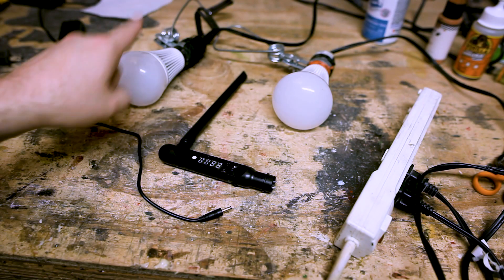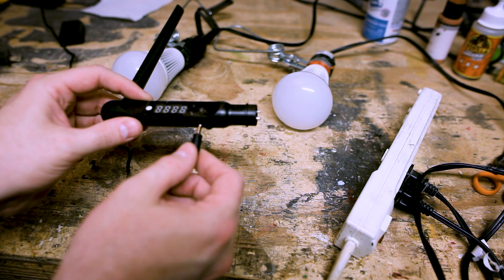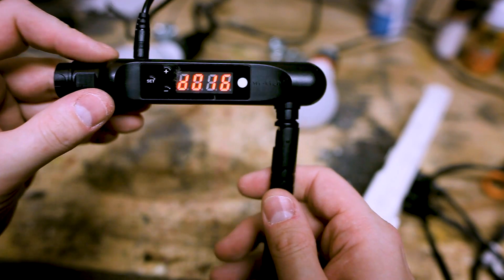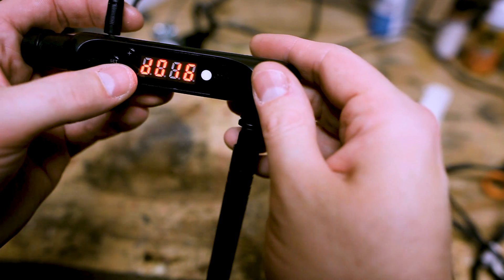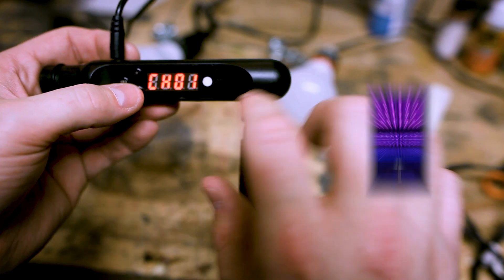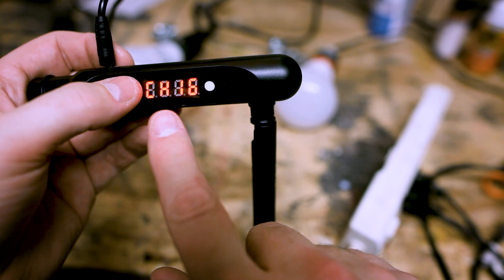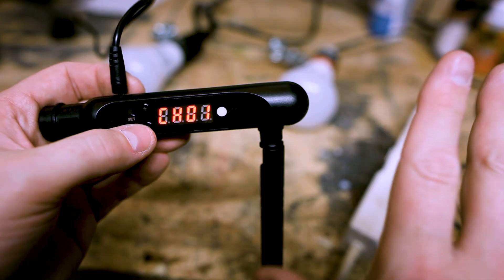Let's look at how to program the bulbs to the transmitter. First off, you need to plug it in. This is a 5-volt plug that it comes with, and it turns on. The first thing that pops up is D016 — that is the DMX address. If you press plus and minus, it goes to the channels. Each channel can have a — they claim infinite — so a ridiculous number of bulbs, and there are 16 channels. That is 80 channels of DMX total, because each channel takes 5 sliders.